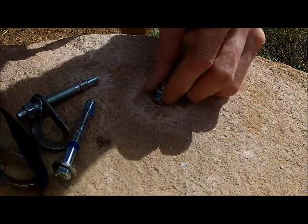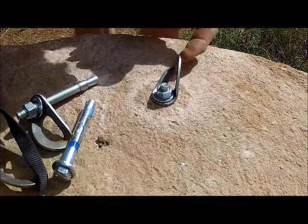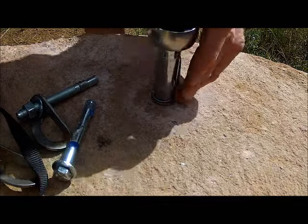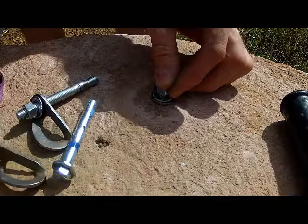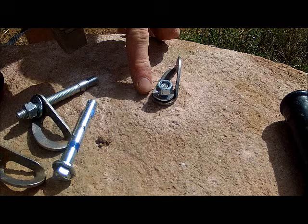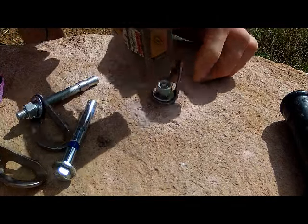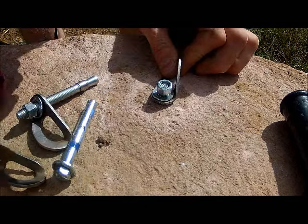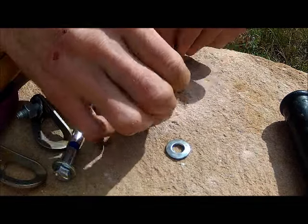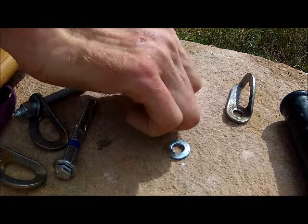We have an SMC hanger and a carbon steel bolt placed in a vertical orientation, like you'll never see in the field. I'm going to first loosen off the nut, then pound on the nut — not the end of the bolt — to force this bolt about an eighth to a quarter inch back down into the hole. Right now it's very firm, but after doing that, the bolt is loose. I can wiggle it, I can turn it. And that's a good thing.